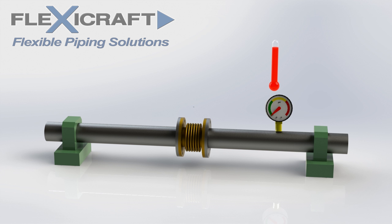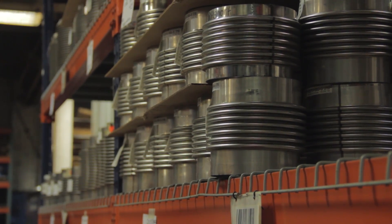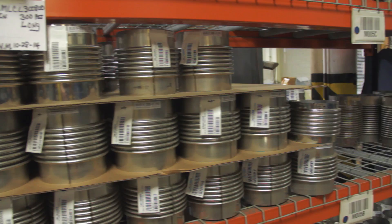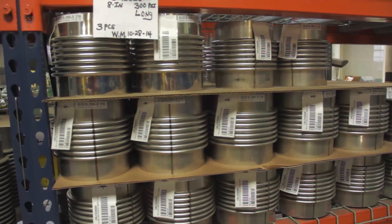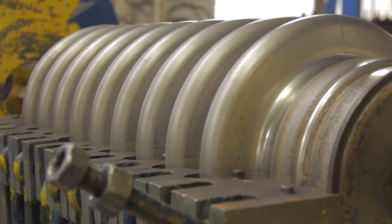Although applications are not always this straightforward, most are a variation of what we see here. Adding metal joints is often a key way to handle expanding hot pipes. Metal joints usually have a stainless steel bellows with multiple corrugations that provide them with the ability to move. They can achieve long lives even in the higher temperatures and pressures of demanding systems such as steam and many others.